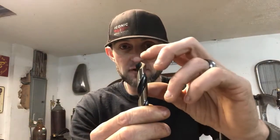I've had some that are flatter than that and they cut well. But what you can do is sharpen one on a test piece. Go get you a piece of steel. Put it in your electric drill, your drill press, whatever, and you watch. This thing will start making chips like a milling bit. And over the years, practice makes perfect. So the more you do it, the more you feel comfortable. You'll go over to it, you'll sharpen it, you'll put it in the drill, and you'll start drilling. You won't even think twice, oh, do I need to test it?